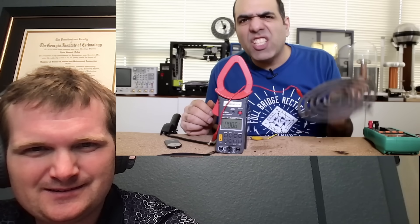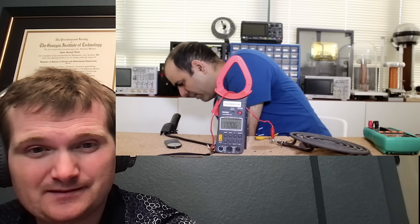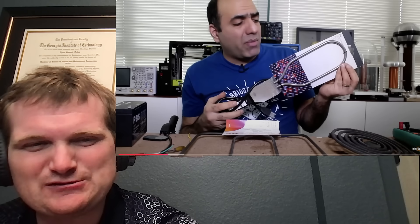This thing is a heating element and can get very hot even running on 120 volt AC - even lower voltages can make it hot and pretty uncomfortable to sit on anyway. So he goes and buys some other heating elements. One is an electric charcoal starter - don't use it on babies! It's pretty nice and fits the seat well, made for 240 volt at 3000 watts. Running it on 120 volt AC means four times less power, or 750 watts. It can still burn, so he plans to reduce the power using a light dimmer.